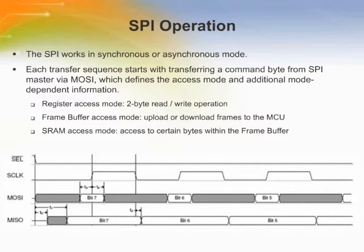The SPI is based on a byte-oriented protocol and is always a bi-directional communication between a master and slave. The SPI master starts the transfer by asserting SELECT LOW. Then the master generates eight SPI clock cycles to transfer a byte to the radio transceiver via MOSI. At the same time, the slave transfers one byte to the master. When the master wants to receive one byte of data from the slave, it must also transmit one byte to the slave. All bytes are transferred most significant bit first. A SPI transaction is finished by releasing the SELECT line by setting it HIGH.